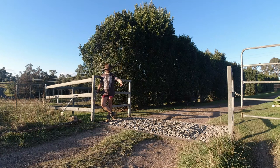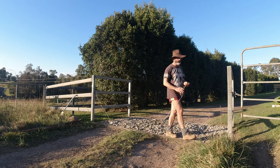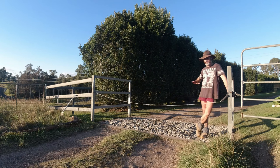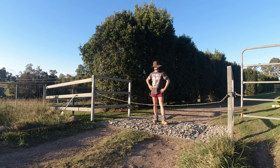There's probably a few of you thinking why didn't we go with a conventional grid. All these steel posts you see at the corners are all welded to I-beams right round, and the whole fence is welded. It was hard to get this grid out to replace it with another grid. I could have gone with rails across the top, but it had no concrete underneath - I would have had to put reinforcing RHS sections and I-beams through the centre to support it. Rather than do that, I just went straight to the rocks. You're probably thinking the cows are going to walk straight over it. Since I've been doing cell grazing and using a single hot wire, the cattle don't go through a single hot wire. When this grid was sagged with those bars, that hot wire - even though it's not electrified - the cows weren't going through it. So I don't need to put the cattle grid back with the bars across it. That wire is sufficient and that's why I went that way.